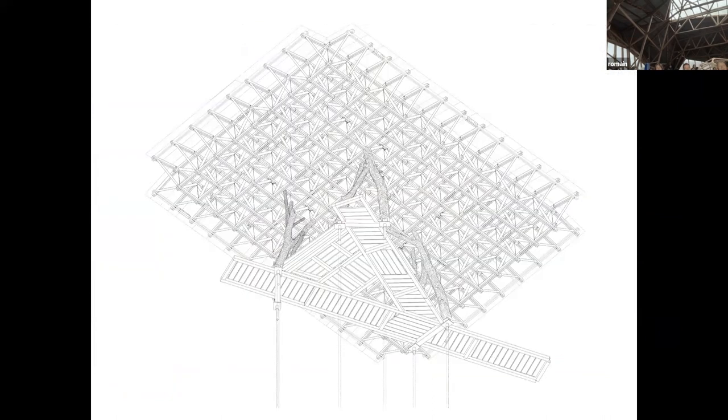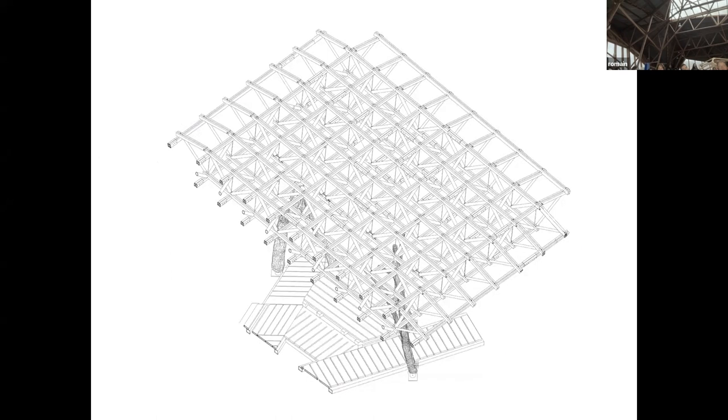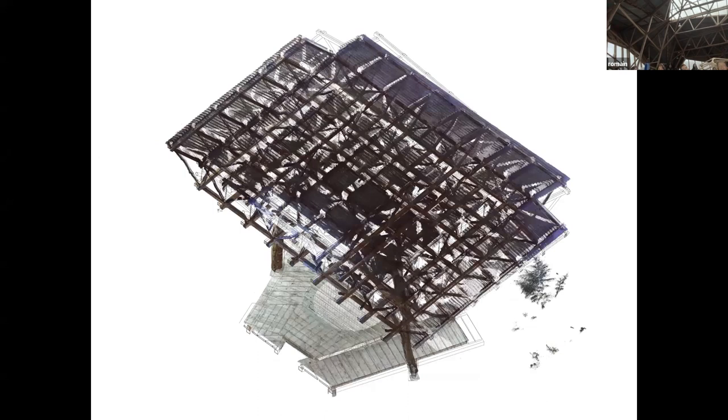But looking at a comparison between the physical build and the LiDAR scan that was done mid-December, we noticed that between this digital model and the final build, there's a 3-degree pivot horizontally. And vertically, there is a 1-degree slope too little. But I think it's quite interesting to see this as a post-analysis of construction, even within any kind of construction outside, to see how these buildings actually shift, or how you imagine them in reality and how they actually turn out afterwards.